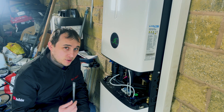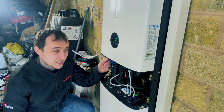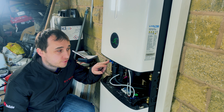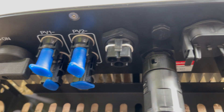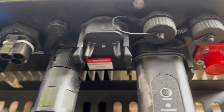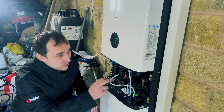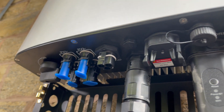Looking at a couple of technical features: we have a DC isolator here for the solar strings. We have two separate MPPTs, which means you can have two strings of solar — one for your east roof, one for your west — without any extra components draining your power. We then have the main incoming supply connection for charging and discharging the battery, and we have a backup EPS supply, which I haven't got connected in this scenario.